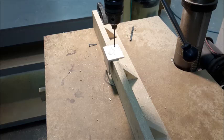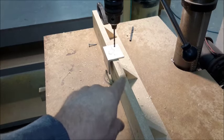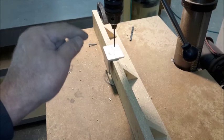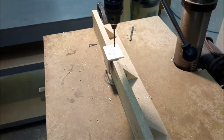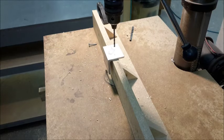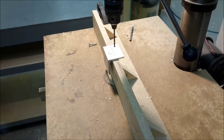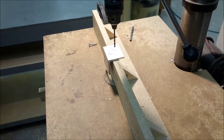Okay, I'm over here set up at the drill press. I've got the angle fence that I use frequently for throwing things against, you know, to measure or to drill accurate, you know, holes aligned. And for this purpose, I'm just going to use that to hold the angle up off of the table surface. That way I don't have to have any, like, stupid block or something like that. Of course, this is a block. But anyway, I got the bit set in there that I think is the clearance for another of those truss head screws. So let's find out.